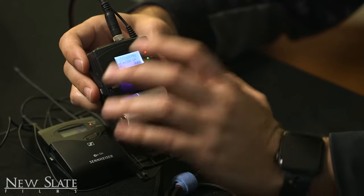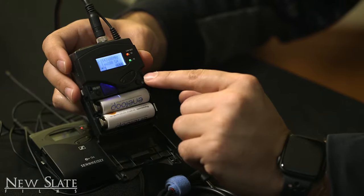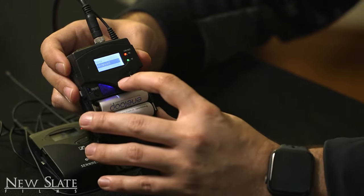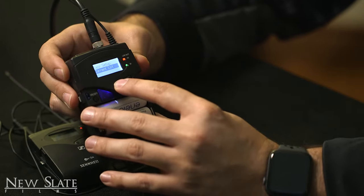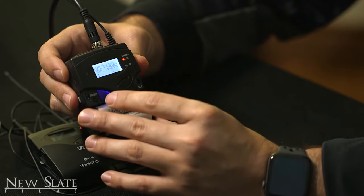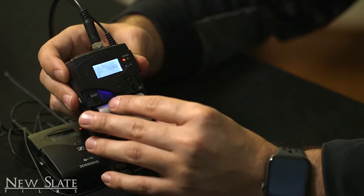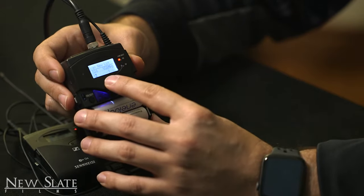This is just step one, and then I'll show you what to set right after that. On your receiver pack — this is the one with the XLR connection — press SET, then go down in the menu to Easy Setup, then press SET again. When you show up to a new location, you want to scan a new list.